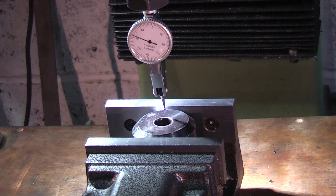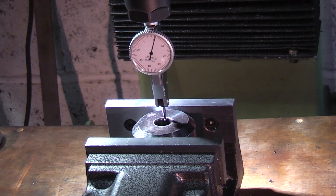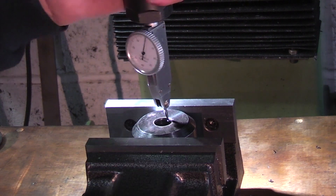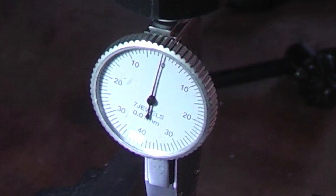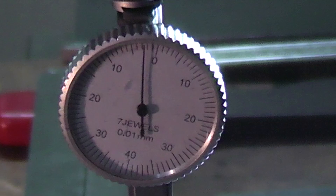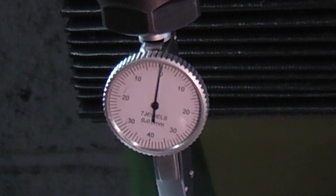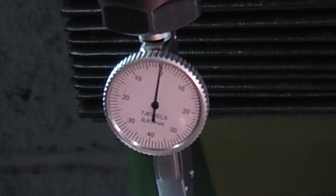What I've done is put the dial indicator in the spindle and lowered it into the bore. I'll set it to zero — it's nearly on zero anyway. I'll turn it round: you can see there it's 0.01, this is the back of the milling machine and the reading is 0.03, this is the other side and it's 0.025, back to the front and it's back to zero. So on average the edge finder found the centre of the hole to within 0.015 mm — so I'd have to move it 0.015 to be on centre line, which is less than a thou.